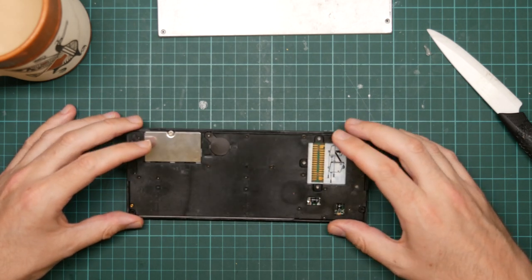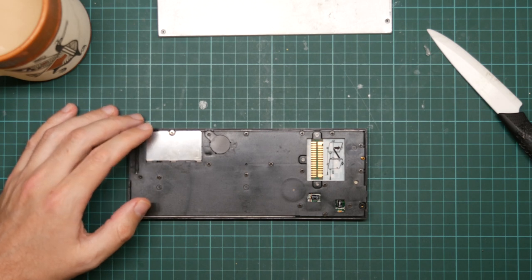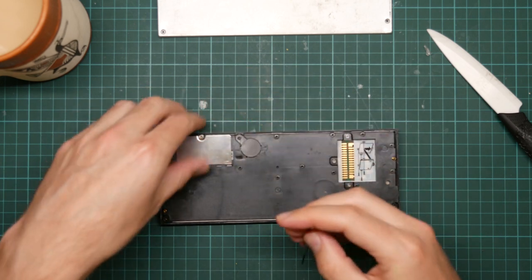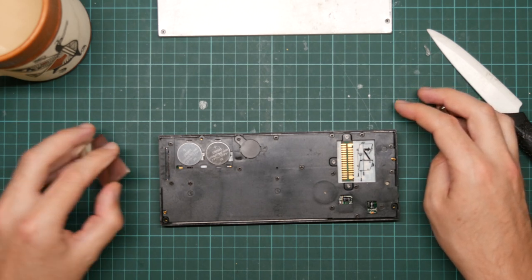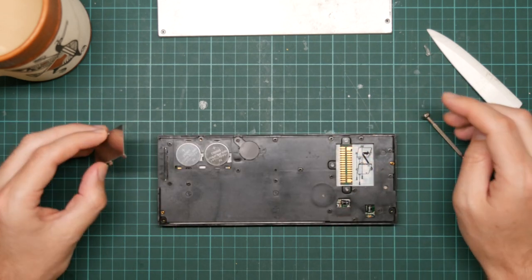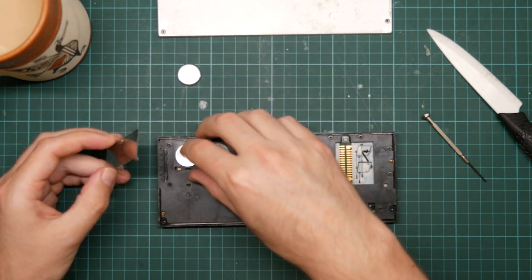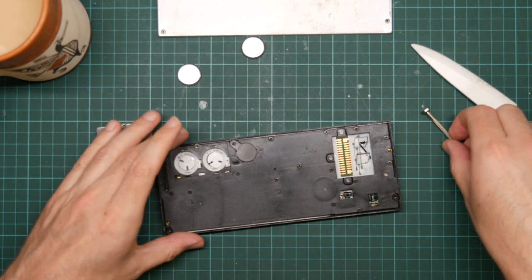explore the bus. There's very little known about this CPU, and I'm hoping that I can build something that will snoop the bus and hopefully reveal the contents of the ROM. The CPU is known to be a Harvard architecture device. So ROM and RAM occupy different address spaces. In some ways that's good because it means you get like 64K of available RAM plus 64K probably of ROM space. In others it's difficult because you can't easily upload code onto it.